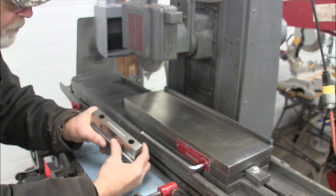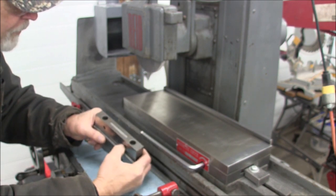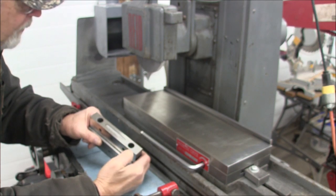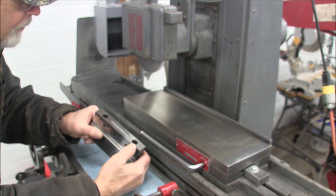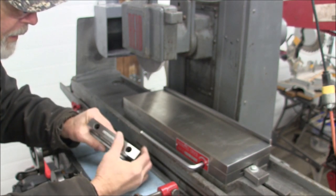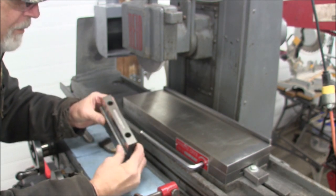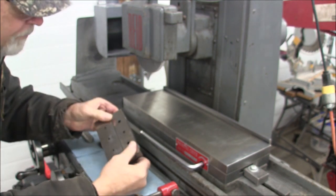So if you push your wheel too far into needing a dress, I'm kind of convinced that putting that much force on your wheel can actually shift it on the hub. And what people are thinking is wheel out of balance is actually you're shifting the wheel off center, and it's not running concentric with the spindle of the machine. So that's my theory on it, but I've never felt like I had to do it, and maybe I haven't always got the perfect surface finishes, but the name of the game is not surface finish, it's accuracy. So, that's just my two cents.